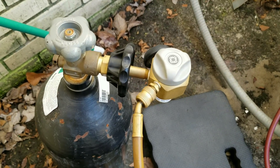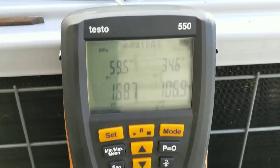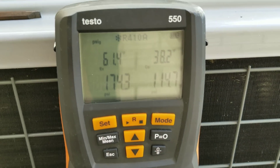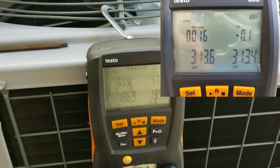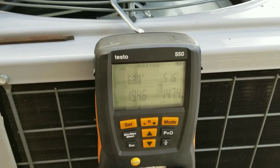Got the Viper 500 throwing some nitrogen in this thing. Thankfully the dryer's outside so I don't have to mess around in that attic — not a whole lot of space up there. I'm gonna put the first nitrogen charge up to about 200, go upstairs and soap bubble it. If that looks good, I'll throw it up to about 350 and let it sit for 15 minutes to make sure we don't have any pressure drop before we swap that dryer and start the evacuation.